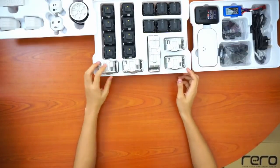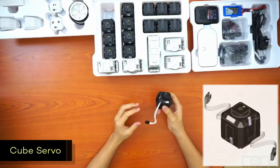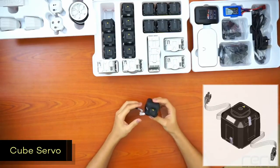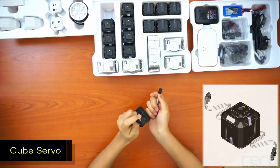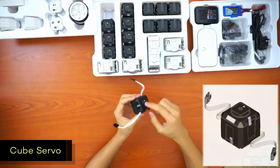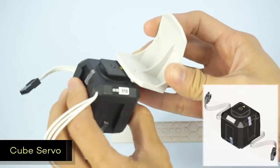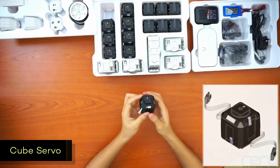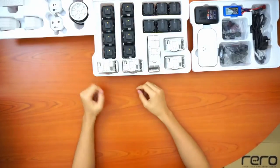Now for the second tray — there are eight cube servos. The cube servos are practically the servo motors for the Rero set; you can say they're the muscles of the robot. You need the cube servos so that the robot can move. They are characterized by two wires, one male and one female, and an output connector. You need to connect the parts following the yellow arrow for correct orientation. All eight cube servos have their own different IDs, so the controller knows which one it is communicating with.